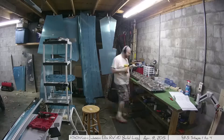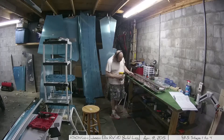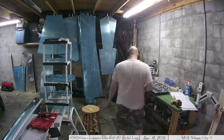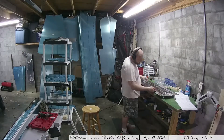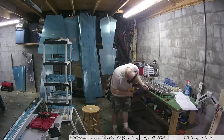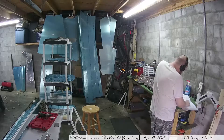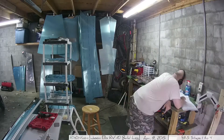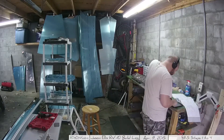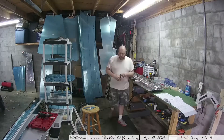Eventually I find that I need to go through and match-drill all of the holes on the leading and trailing edges and the ribs. There's a lot of match drilling in this project - you do a lot of drilling and you get really good with a drill. I decided that using the long drill bit here was easier because there are a couple of spots where the skin is sticking out too far. We're putting the shear clips in place and drilling through those. They'll come into play in a bit - very important pieces. I didn't realize until much later how important they actually are.